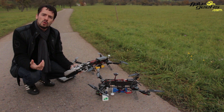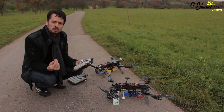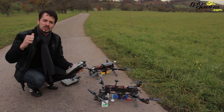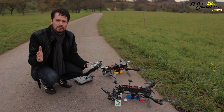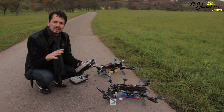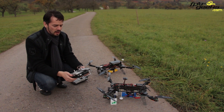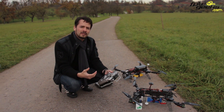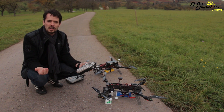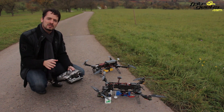For those who know about the follow mode of the APM and PixHawk, there are six specific sub-modes you can set: leash mode, lead mode, left and right mode — which means the copter stays behind you, right in front of you, or left or right of you — then circle mode and above mode. For our first test we start with leash mode, which means the copter always follows behind the manually controlled copter. If this works fine, we will probably select circle mode and have the follow copter circle around the other one.